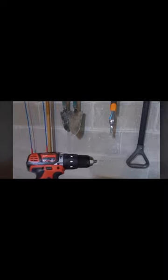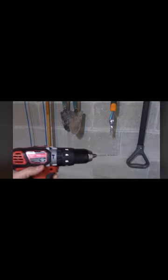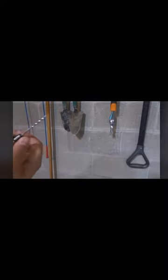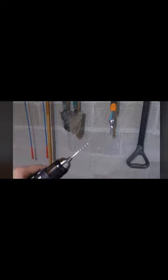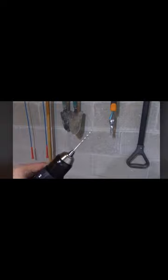When using a hammer drill, you'll likely be drilling into concrete or something tough. The most important thing is to use a drill bit appropriate for the material you are drilling into. A concrete bit is needed for drilling into concrete — using a wood bit will not work and may break the bit. Make absolutely sure you are using the right bit.